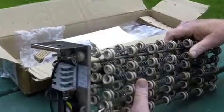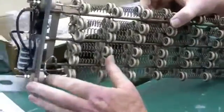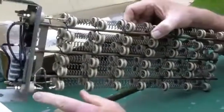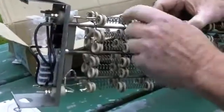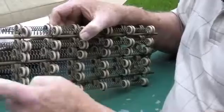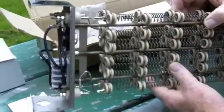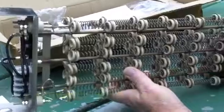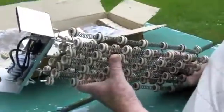The way the coil is designed, it has redundant safeties. These are called fusible links, and they are fail-safes. If the temperature limit switch at 200 degrees — which controls the air temperature inside the coil — ever exceeds that, or if the switch fails, these burn through internally and shut the system down. There's no way that this system can get over 333 degrees. It will shut off, period. So it's a 100% safe system.